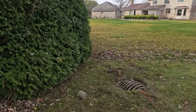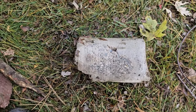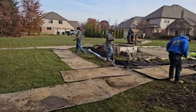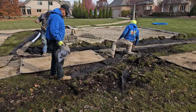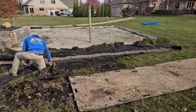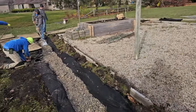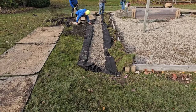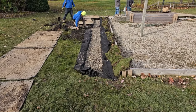These storm drains — I want you to see just how thick the concrete is. That cement plug there, that's how thick the wall is — it takes a little bit to get through. They're usually 10 to 12 inches thick, and sometimes they've got a lot of steel in them too. They really tear up a core bit. Now it's so obvious why two four-inch pipes on the bottom, holding yourself to that tolerance, builds such an amazing French drain — look at that.